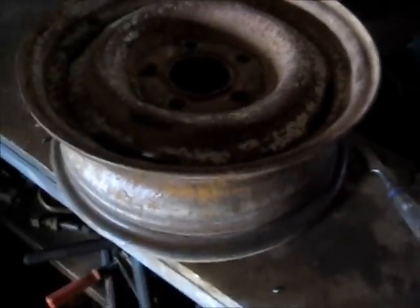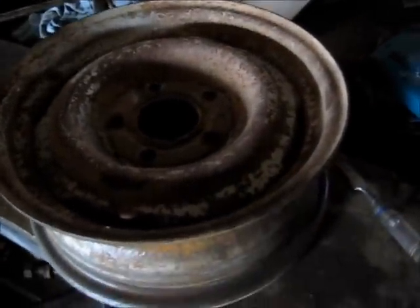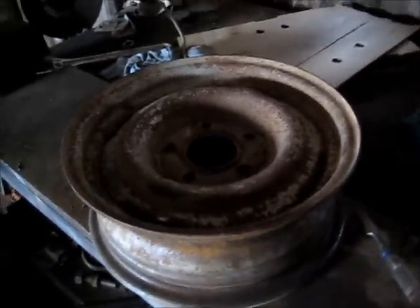The old rim I was going to use — unfortunately because of this bloody rust from the moisture getting in, it's actually rusted completely through the rim. You can see right through that — it's rusted right through so this rim's gone. It may not even be worth patching because moisture is going to sit in there and weaken all that area. When you've got a couple of tons of weight in it, it's going to pop. It'll be quite dangerous. That rim's screwed. Lucky I checked that because it would have snapped and gave way with two more tonnes of grapes on it — that would have been a bloody disaster.